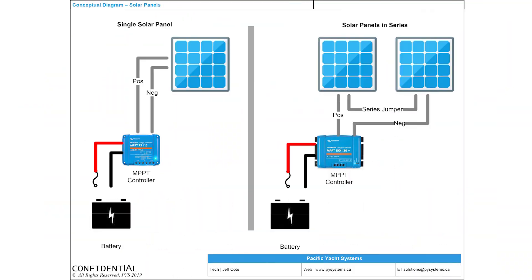Although some controllers do allow both, so you've got to figure that out. Once you know your battery voltage, then you want to know what is the maximum wattage that's going to come into the solar controller. The maximum wattage could be two panels in series or two panels in parallel. The voltages are going to be different depending on series or parallel, but the wattage won't change. So if you've got two 170-watt panels, you have a 340-watt solar array. You want a solar controller that will allow up to 340 watts input.